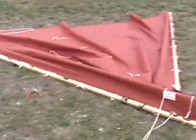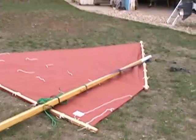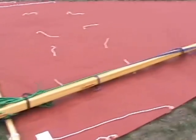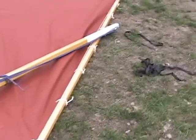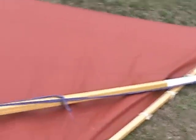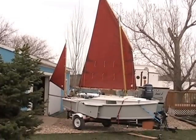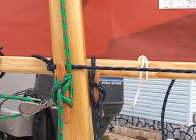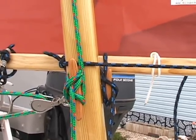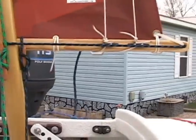So now I need to get the boat out of the shop and get the rig set up on it. Got my mast sitting on here. Now I'm wondering if this mast is going to hoist it high enough — I used a 14-foot mast rather than a 16, because the plans looked like it would work if I hoist right to the top of it, but I don't know. That mast might not be long enough; I might have to splice in a piece. Well, this is a pleasant surprise — the mast is tall enough, just barely. I'd like to get a little more down, maybe I can move that down or cleat down a little bit, or just cut the top off of it. When the boom swings around to the front it won't be a problem when I'm reefed, just with full sail. She's going to set a little low, and I knew she would.